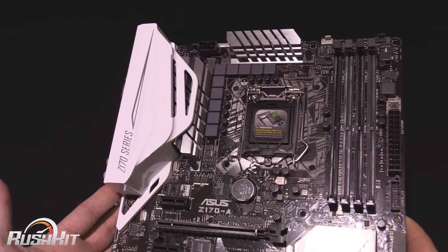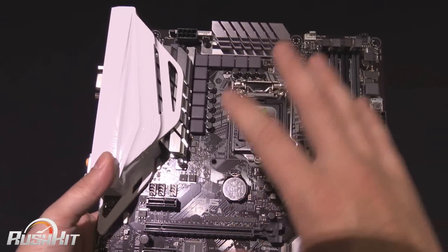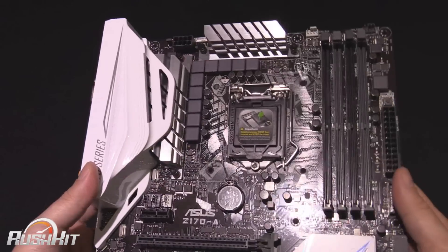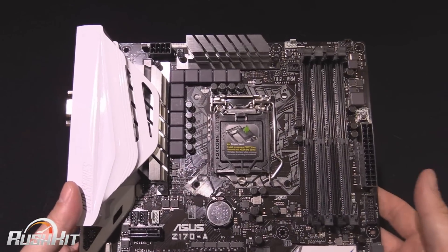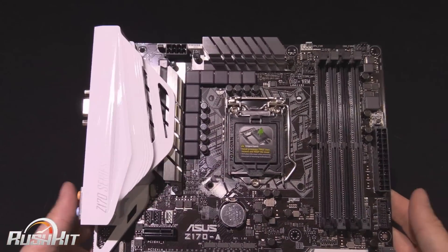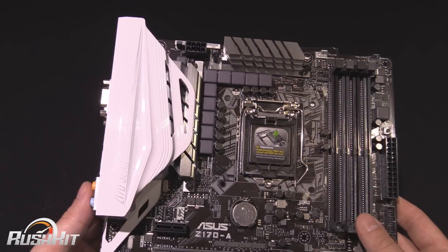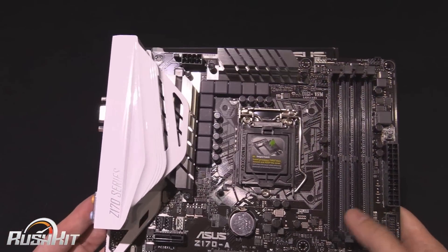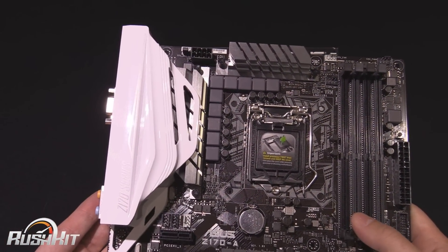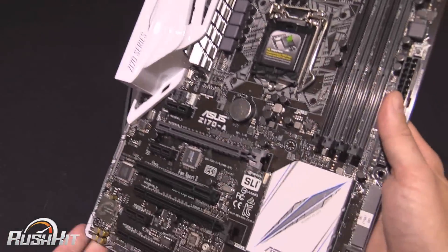I did my 6600K and 6700K tests on this board — this was the board I used for my review. With the i7 I managed to get 350 base clock, a 4.8GHz overclock, and I managed to get 5GHz just by doing the multiplier. I also managed to get 3700MHz memory running — all with this £115 board.